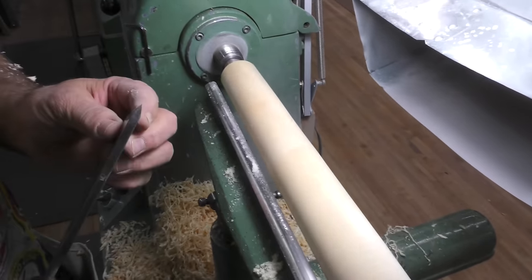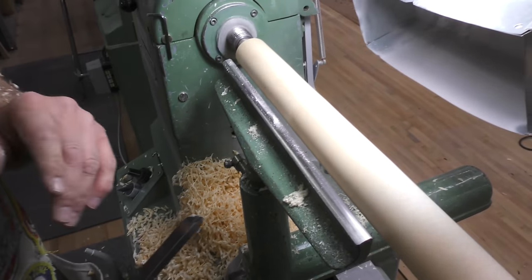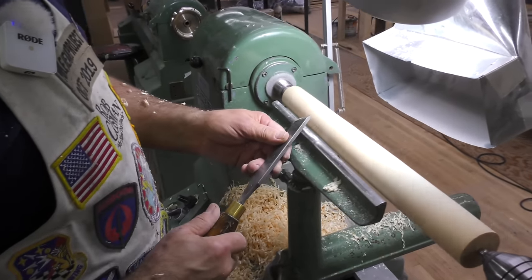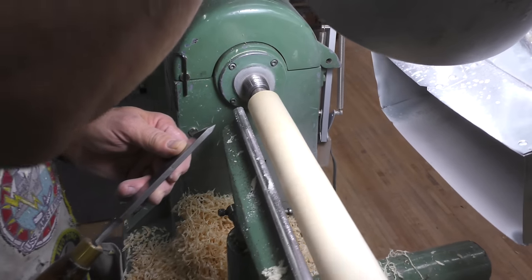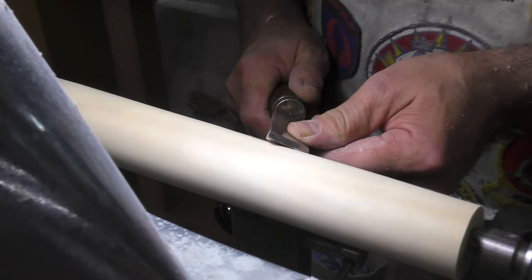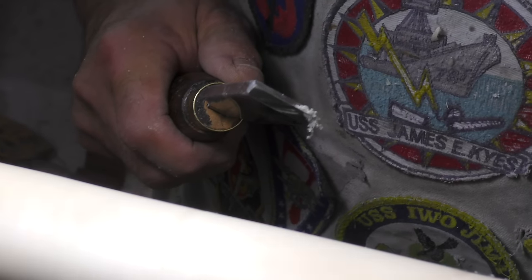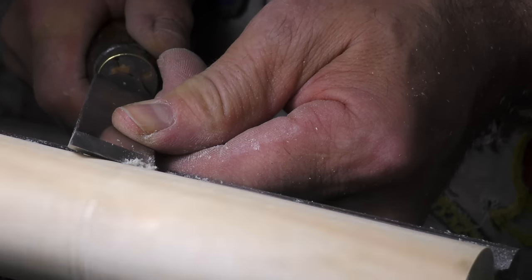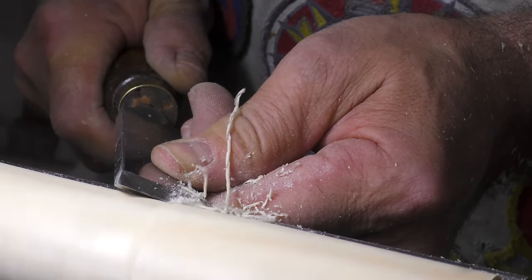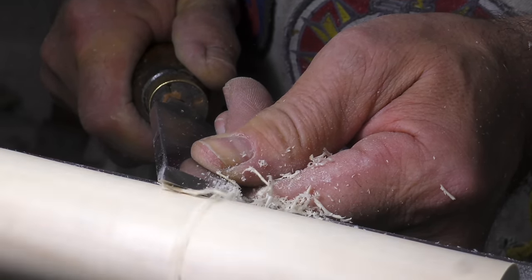At slow speed, the first thing is to find where that bevel is. You always want to be working on the lower half — the lower third is even better. If you get above there the tool is going to dig in and bite, which is one reason to practice on soft wood so it's not so scary. Get the bevel resting on there — I'm not biting it in. Now I'm going to rotate just a little bit. The bevel is still making contact and it's preventing the cutting edge from digging in any more than I allow it. Just like a plane, it shears that wood off and gives you a beautiful finish.